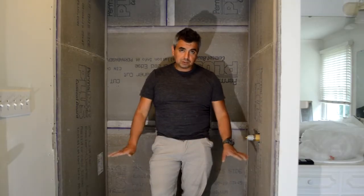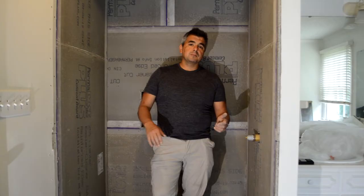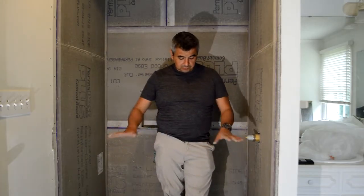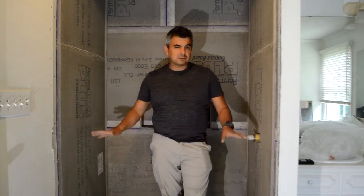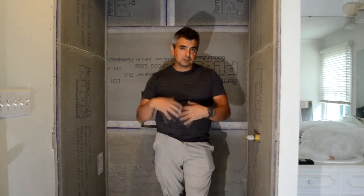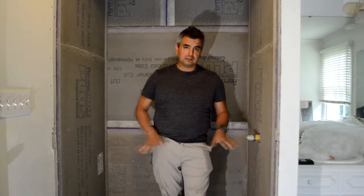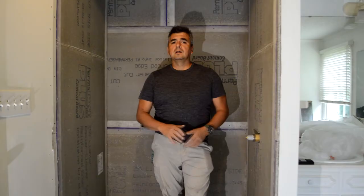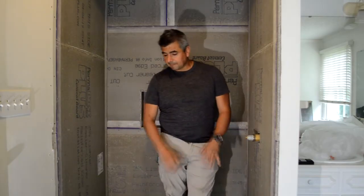But once you do that, you ensure that water's not gonna get trapped over there, because the problem sometimes is that water seeps through the bed of concrete that you're building, or that cement, or like sand topping cement, whatever you use. This guy loved using sand topping, sand mix. That's like sand and concrete together and makes that bed. It's called top coat or bedding mix in different places, right? Or sand mix, sand topping, whatever.